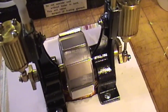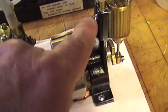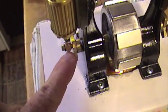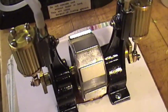It just means all the parts have kind of worn into each other, and it takes a lot of lubrication at points here, here on the oscillating face, the crank, the pin - so this type of engine is going to take a little bit of oiling each time you run it.